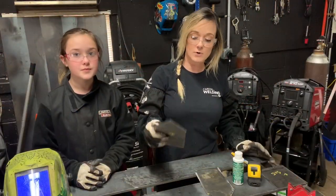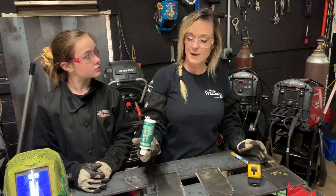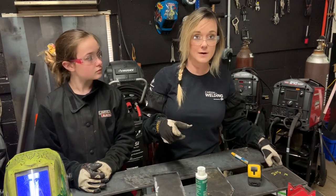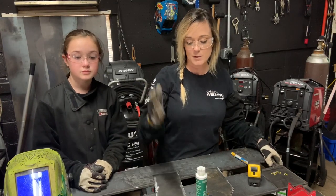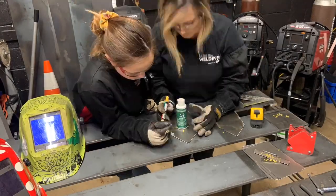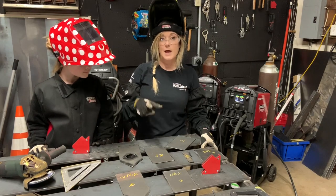We've cut our angles for the roof on the front and back. Now we need to put the opening for the bird. I found a bottle of Aluma-Cut — it's about an inch and a half circle — so we're going to find center, mark out our circle, and cut it with the plasma cutter. If you don't have a plasma cutter at home you'll need a hole saw bit, or if you want a square opening you can just take a cutoff wheel and cut a little square in there. We've got all our pieces cut and cleaned up, now it's time to start welding.